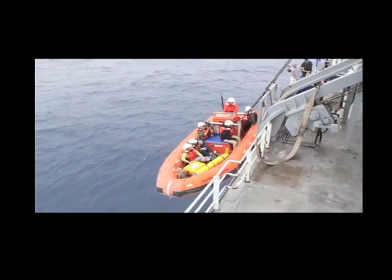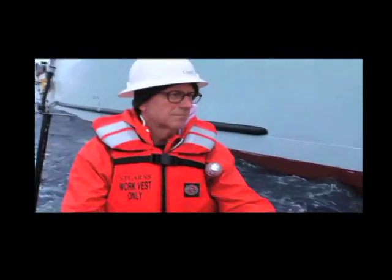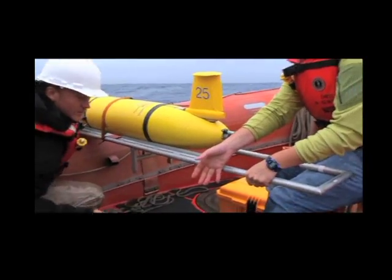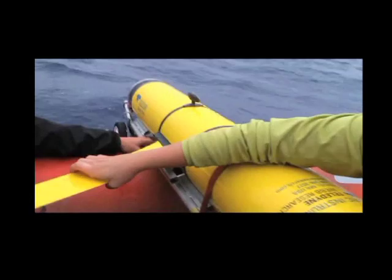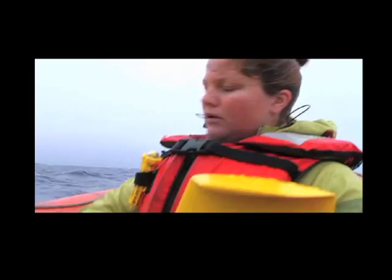Here we have some video footage of the actual deployment that we did of RU-25, which is the glider that I brought on board with Thomas G. Thompson. We use small boat ops because it's a lot easier to control the glider staying away from the boat than accidentally getting sucked under it, which would potentially be catastrophic. Small boat ops off of large ships enable us to do deployments pretty much all over the world. We do a lot of Antarctic work, and a lot of that's all based out of small Zodiacs as well. You can see it was actually a little bit of a rough ride this day, but the cart that the glider's on actually acts as a cradle. Before deployment, it's important to make sure we put the wings on — you can see that we snap them in place and then give them a wiggle to make sure they're nice and secure. There are also some pre-dive checkouts that will go through, which will either be done by myself aboard the Zodiac or from the cool room. This deployment, I actually had the cool room take over just because it was a little wet and dicey on the boat.